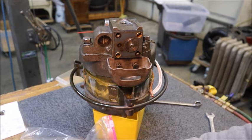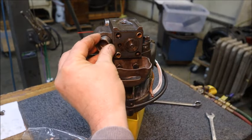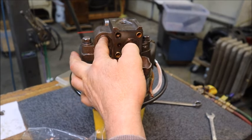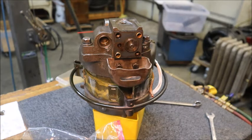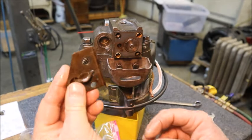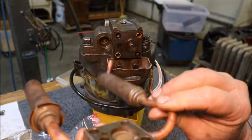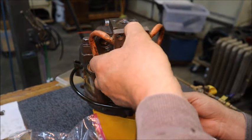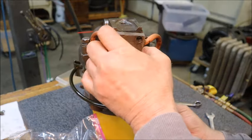This bore is the hydraulic unloader piston. This piston goes in there and forms the oil pressure relief. It also controls the unloading function of the compressor - there's a mechanism that'll hold that suction reed open, allowing it to spool up without any pressure against it. I did braze a coupler on here so that it can be connected back. Getting that on there is going to be real fiddly.